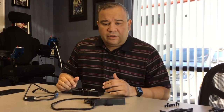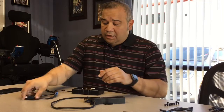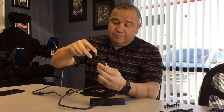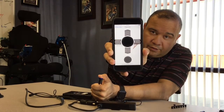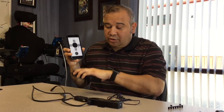And then we also tried a joystick. I'm going to show you how we did all that without a chair. We were on an assessment table with the family. We got some bean bags and put them around the child to place the switches near his hand. This is a standard 12-volt battery powering up our interface — 9-pin plugs into a 9-pin right here. Nothing is plugged into the interface right now, so we're going to open up the software and go into diagnostic view. You can see it activating right here on the diagnostic view. It's got a 12-volt battery so it thinks it's on a chair, and I can start to apply different features to it.